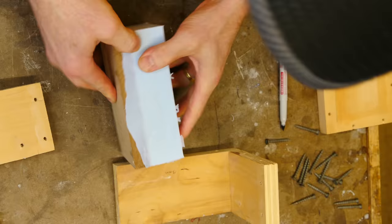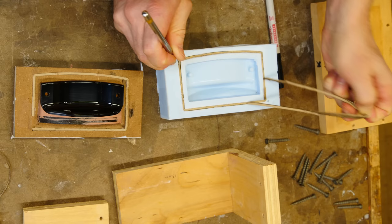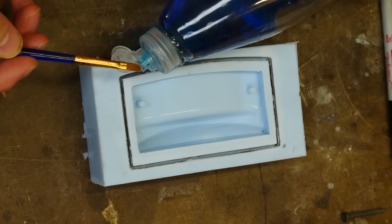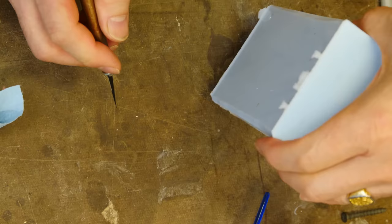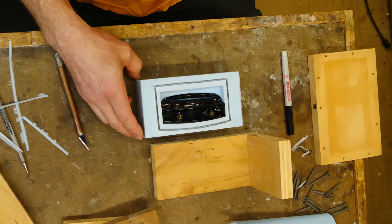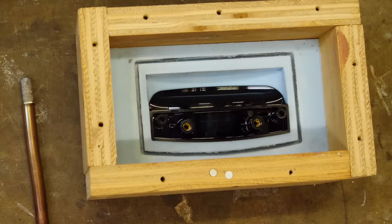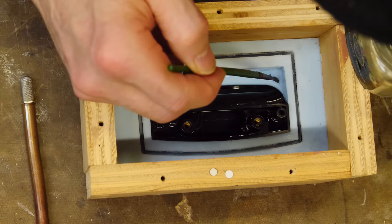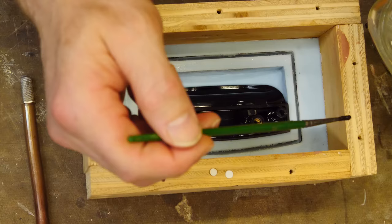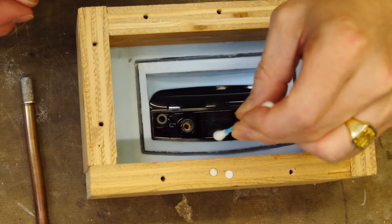Twelve hours later the silicone has cured — let's remove the base from the silicone mold. It's not always possible to do this inside the mold box; in this case I have to disassemble everything, which is not ideal but unavoidable. Let's remove the keyway and the master part. I need to put a little bit of dishwashing detergent on the silicone sprues so I can get the part to fit snugly back inside the mold. I remove and cut off the excess little pieces on the bottom of the mold so I can lay flat inside the mold box and reassemble everything. It's vitally important that you add a release agent to the exposed silicone — if you don't, the next half of the silicone mold you pour will stick right to it. Only place your release agent on the silicone, not on the part. In this case my release agent was naphtha and Vaseline — the Vaseline thinned out with the naphtha.